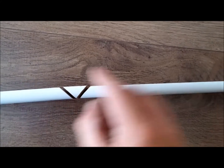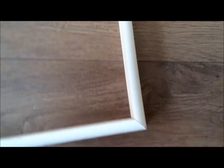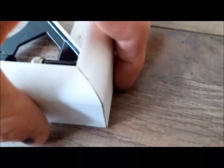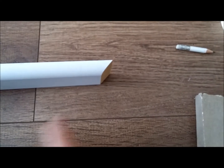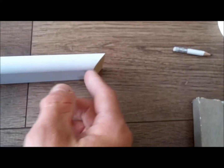You should now have a length where the two cut edges are both angled at the same 45-degree angle, making a parallelogram. The 45-degree on the main length goes back the other way, so that when these two are joined together we should have a fairly square corner with the edges meeting up nicely and hopefully, once they're square, as little gap as possible. Remember to tape the wood before cutting, and when you sand, only sand very gently — just take any furry burrs off, as you really don't want to change the sharpness of the angles that your saw has cut.